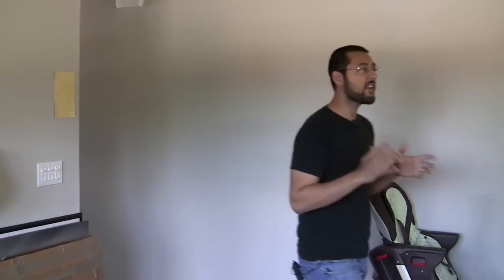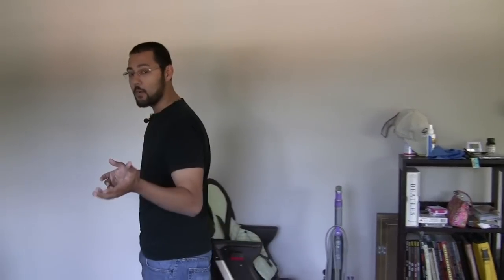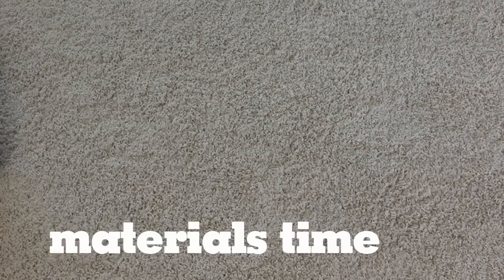The thing is, this house is very limited — the attic is really tight and the basement doesn't exist, there's a crawl space. So I can go under there on my hands and knees and maybe wire the house, but a friend tipped me off: contractors these days sometimes use networking cable instead of telephone wiring. I went into the wall jack and found there was Cat5e already in the walls, so what I had to do was convert the telephone wiring system into a home network.